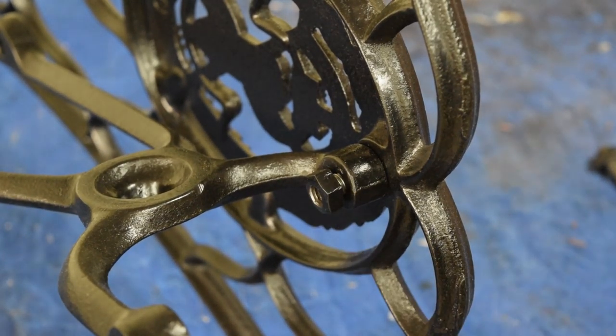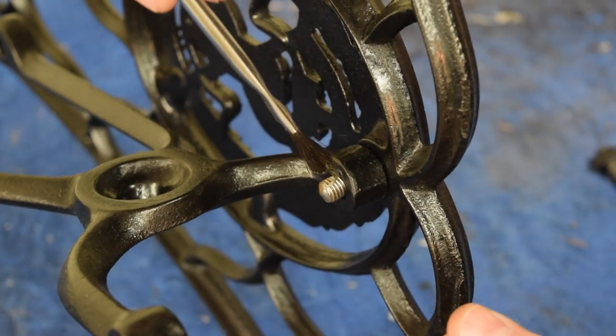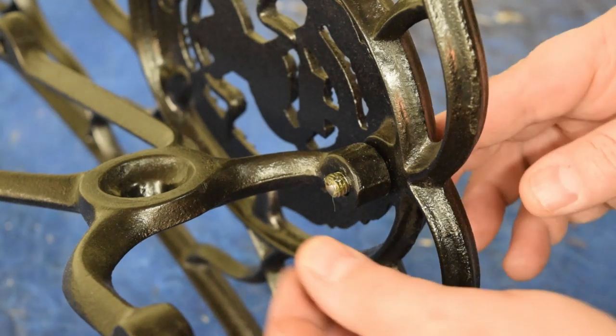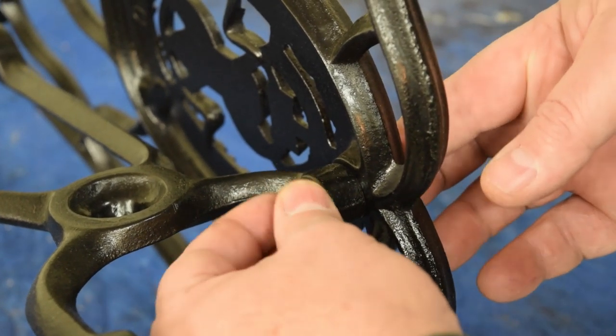Here's one of the bolts that we just put on. What I like to do is just take a little bit of grease and just touch a little bit of grease to the threads before I screw these nuts down. It's just going to help it come apart a little bit easier for the next guy.